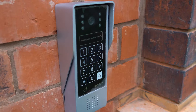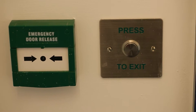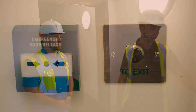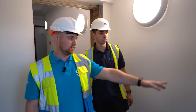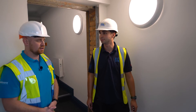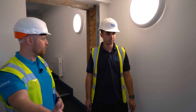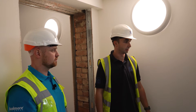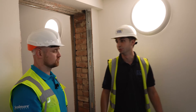What's the purpose of these then? That one is, as it says, push-to-exit — you push that and it will release the door lock. In the event of an emergency you just hit the key switch or the push button and that will stay open until somebody resets it. Is that for regulation, because they're both opening the door? Yes, but if someone's in a panic they can just hit that, it'll release, and all the doors are open.